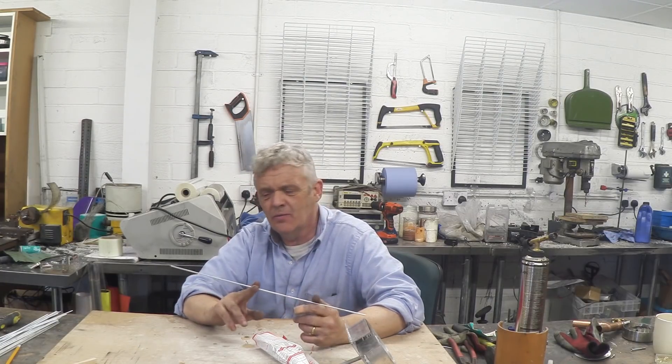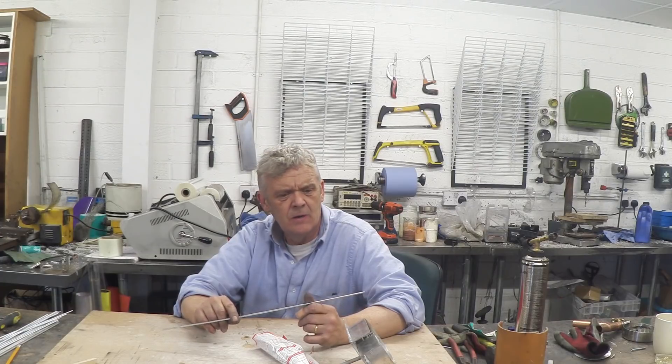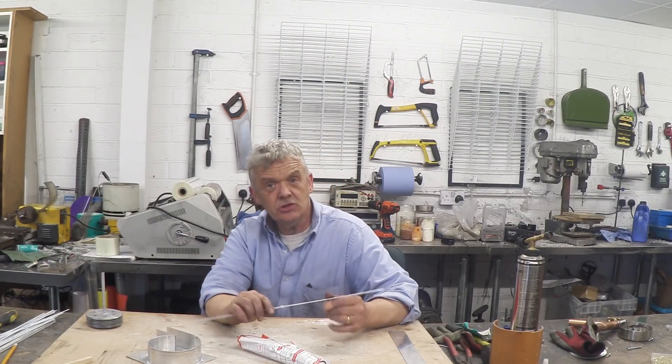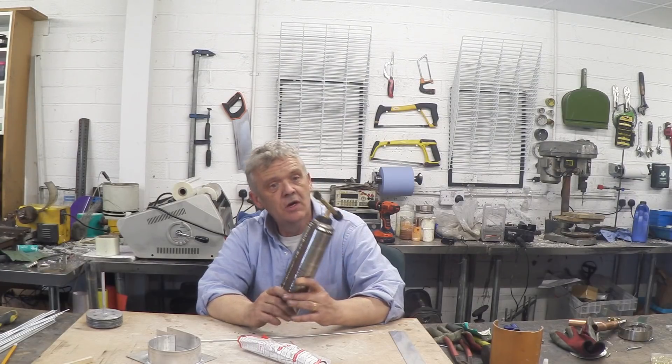I think it's pretty cool. I'm going to play around with it some more because, as you know, I love fabrication. I quite often fold, pop-rivet and screw things together, but I'm going to be aluminium brazing now — which is really cool, because making that involute for the Tesla turbine was a piece of cake. There are cheaper versions around for a few pence a stick; I paid about 40 quid for 30 rods, so a little expensive, but I wanted it to work. All that case is just a strip of flat bar from the local store, put through a metal bender, bent into a circle, and prised open slightly by hand. For the torch, I just used an ordinary butane-propane mix — nothing special, not even particularly expensive.